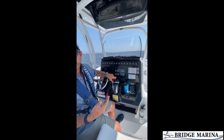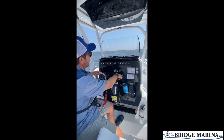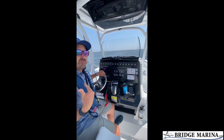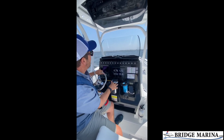I'm going to bring that bow back down and do it the correct way now. I'm going to put my trim all the way down. Just ran my trim all the way down. I still have enough depth — up in 15 feet of water. And this time I go to plane I'm going to go a little more aggressively on that throttle, so it pushes the boat up and onto plane. Let's see the difference in that bow rise.